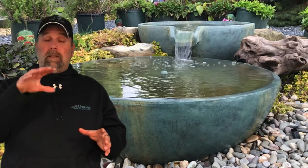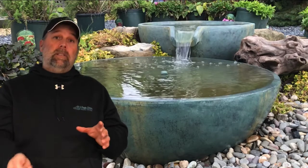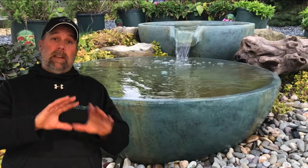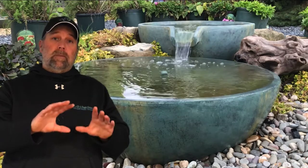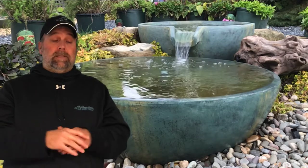We then take the pump basket, put it back in the container that it goes in, put the plugs in there, and then put the lid back on. They'll store the plugs and everything that your pump needs for the winter time without them getting lost. So now your pump is ready to be winterized.